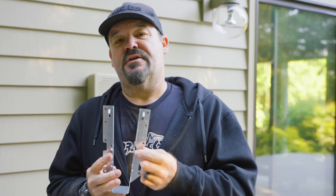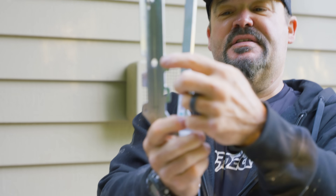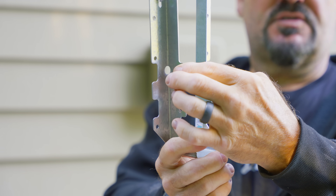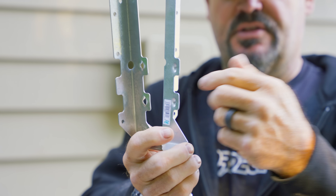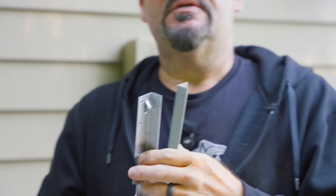Then you have this double shear nail hole right here — there are four of those as well. These heights are staggered a little bit so that the nails cross over without penetrating each other or trying to hit each other on the way in. These ones go in at an angle, and if you're using nails, you have to use a three-inch joist hanger nail. You just can't use any screw that you pick up at Home Depot — they're not structural. They're going to snap, they're going to break.